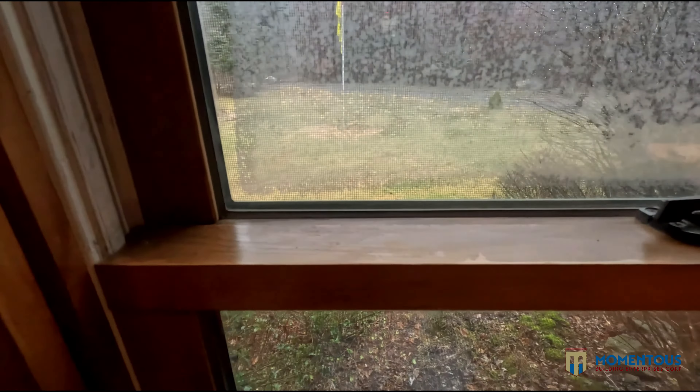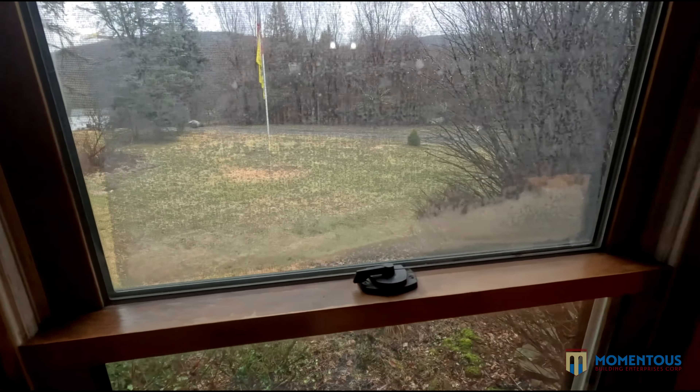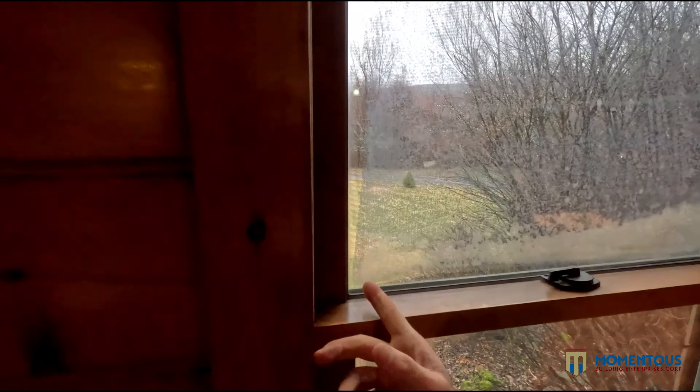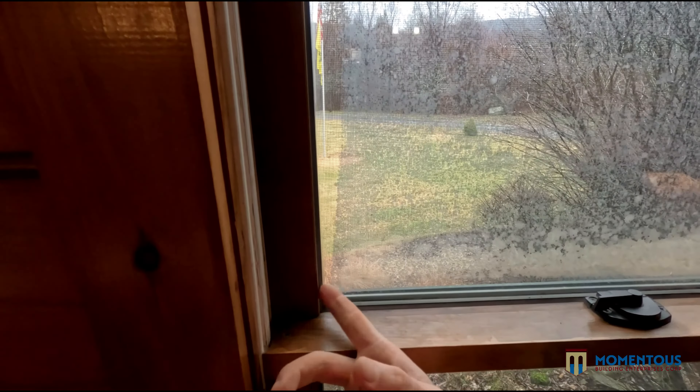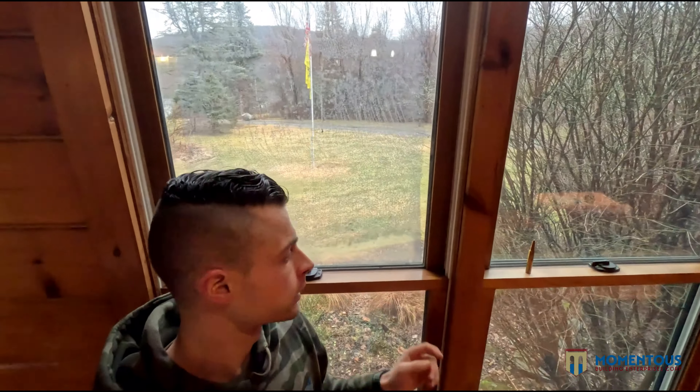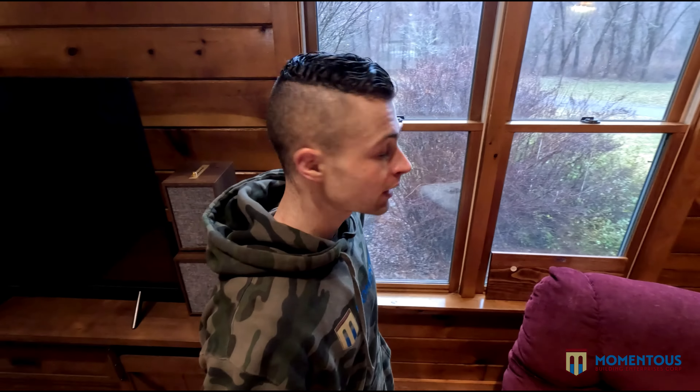Let me show you what a broken seal looks like. On this window right here, it's very evident — you can see that spacing going all the way up. That's what happens when a seal is extremely damaged and broken. Water and moisture get in between the glass and cause damage. Instead of replacing the entire unit, we're just going to replace the glass. You can pop these sashes out, take apart the whole sash, save the wood and frame. These little screws right here come out and you're good to go — a couple-hour job.